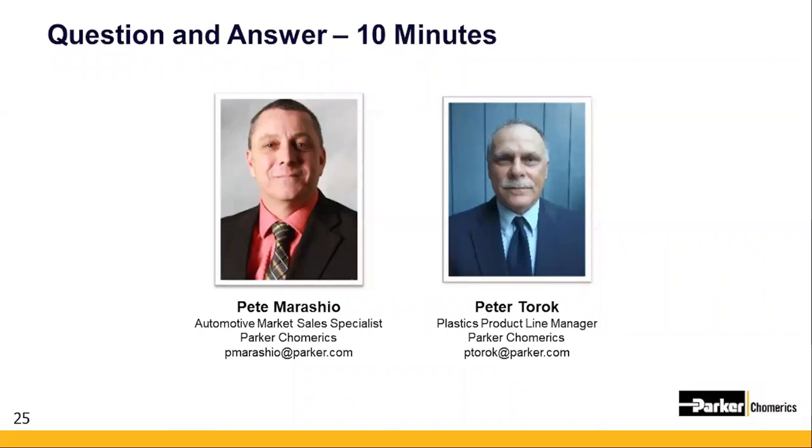Pete? Okay, so there's a question here from one of our own, Ben, on no-touch automation, which is a really good question. As we alluded to in the film, no-touch automation is a key component to getting to 0 defects. You definitely want to have a full process planned out and designed out top to bottom that can not only get all the assembly steps done and all of the staging done, but also validate every step of the way that the step before was done correctly. And the process cannot advance until the step before was done correctly and everything is complete.